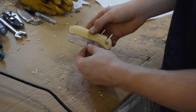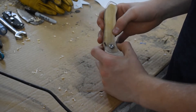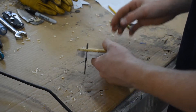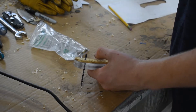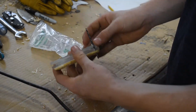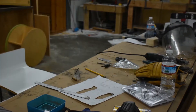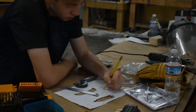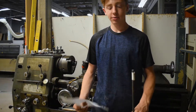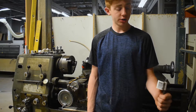This is the first prototype. I just cut a quick scale out on the Avid and I just cut this acrylic on the bandsaw and sanded it to get the right blade shape so that it'll open to the right position and close. I just got some new hardware at the hardware store and some drills and taps. I think we're gonna go down to the metal lathe and try and prototype some new pins. We got our plan, we got some half-inch steel, and let's just try it — even if it goes well we're gonna have to make like three or four more, so let's go.